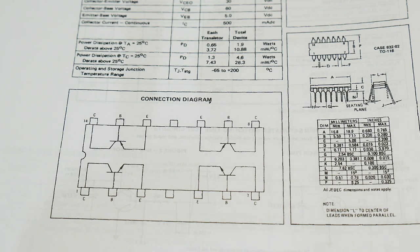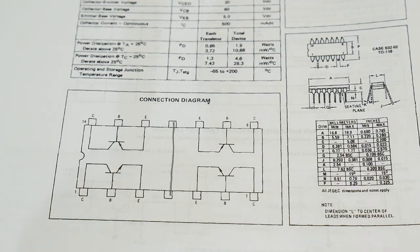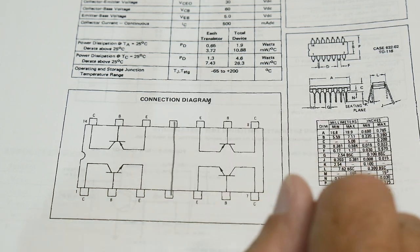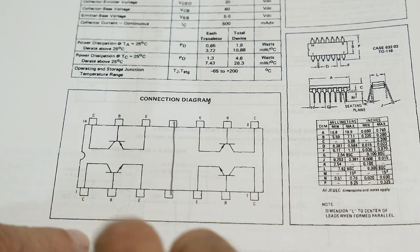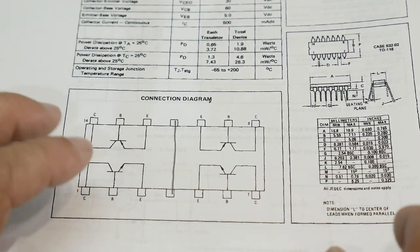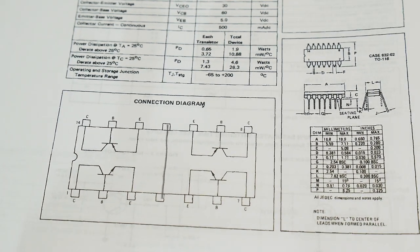But the pinout in that datasheet is incorrect. It actually looks like this — there's actually a short between those two pins. That's our correct pinout. So we have a transistor pair here and a transistor pair here: NPN and PNP. They are supposed to be matched. I say we go measure them and see if they are.